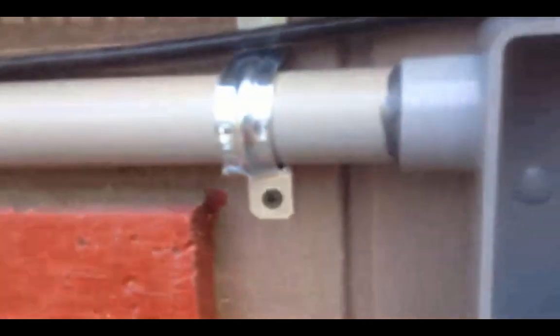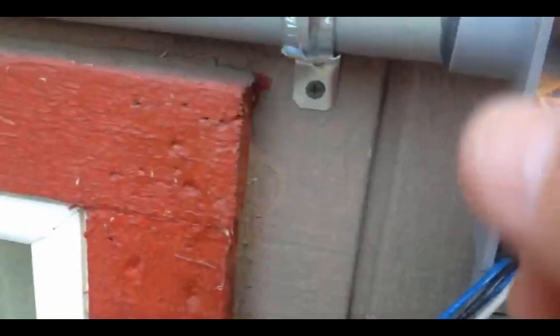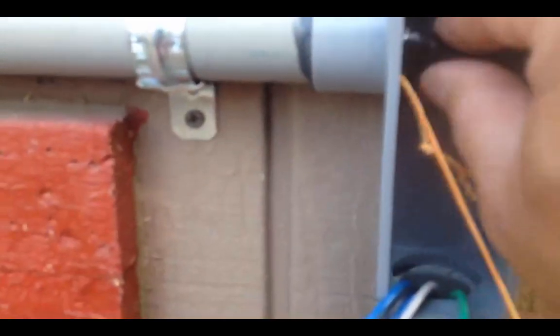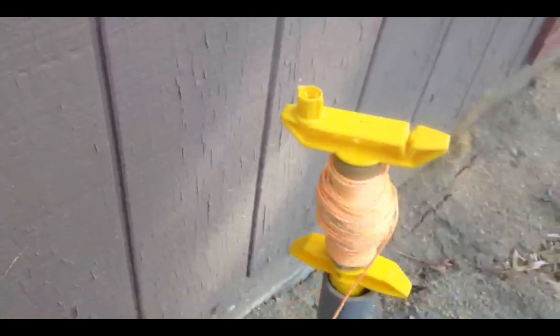This is the line I want to fish through, so I'm going to take the baggie end and just push it up inside the conduit — put it inside the hole, but make sure the bag goes in first. Kind of push it up in there and feed it in a little bit. Make sure your string will roll easily and isn't going to hang up on anything.